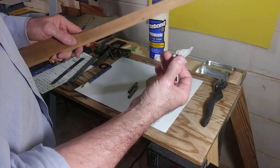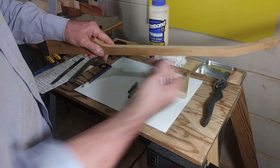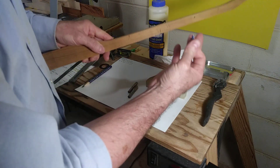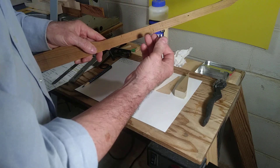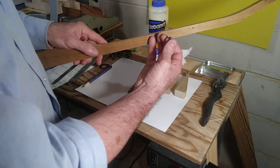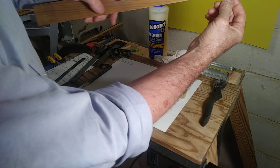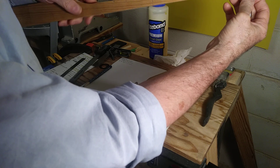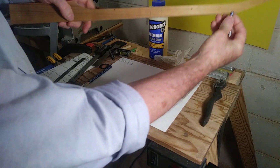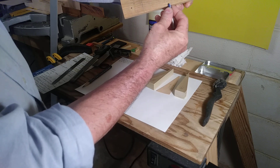The fence doesn't even have to be anything incredible. It just needs to be some sort of straight edge clamped to the table. All you're doing is controlling either the tool or the work piece — you're either moving the tool when working with a piece, or the tool is fixed and you're moving the work piece. I would start out and route up to — obviously you go in, kind of kiss it, pull it up and verify you're directly in the center. Then you push down to a point you've predetermined as your stopping point.